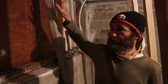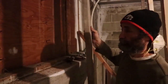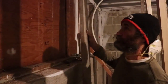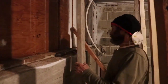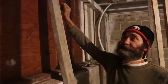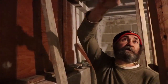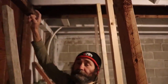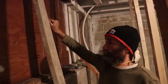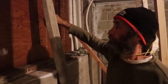So in this case I'm gonna use 2x4. On the other side is the front of the house, and we just want a big window for this room, nice and big. So in this case I'm gonna use most of a 2x4 for now. We just want to put some reinforcement to support the joists up there. So right now we have just a temporary support. So we're just gonna open the wrap for now. We're not gonna remove this plywood yet until the windows are ready to come.